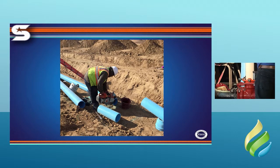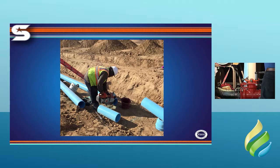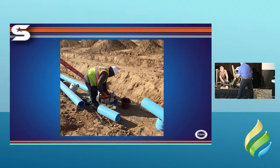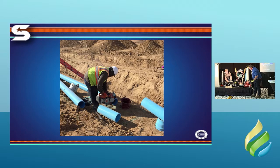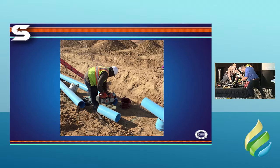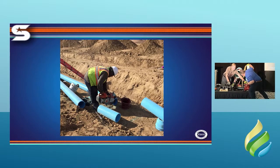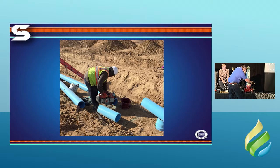So he did crisscross, and now he's just doing one last time around. If you keep going at this on larger diameter, it's even more important you don't just keep chasing it, because gaskets are flexible. He's tightening this bolt. This bolt he hit torque. He's tightening this bolt now. That bolt won't hold, if he goes back, he'll have to tighten it more to get to that 100 foot-pounds again. So you can do crisscross, hit it 3 to 5 times. If you hit it too many times, you're just going to keep compressing that gasket.